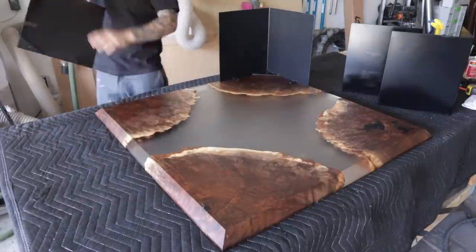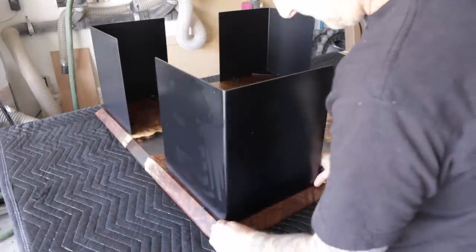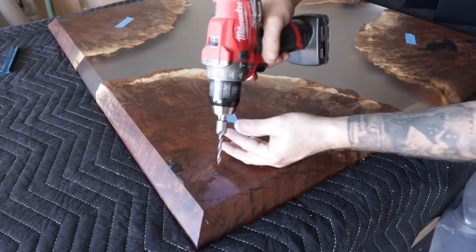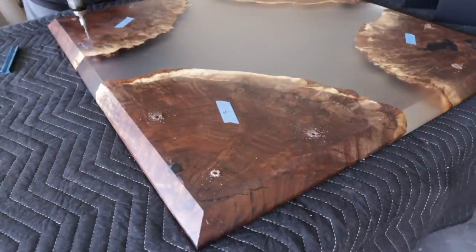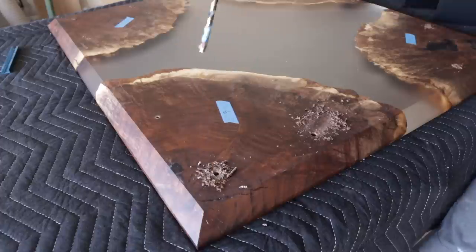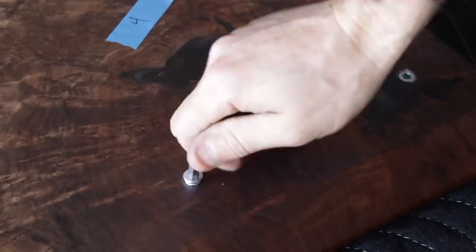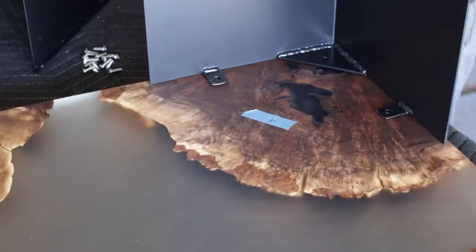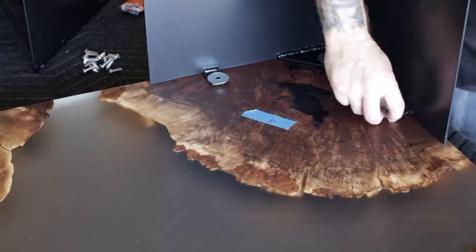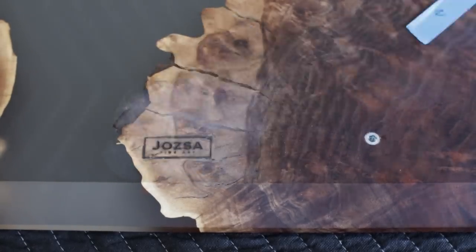I got the legs back — they're not as dirty as they look, just not wiped down yet. I tried to get them in place to see where I liked them, wanting them close to the edge. I marked the holes out and began drilling for the inserts, doing a little pilot drill first to make sure I was where I wanted before doing the actual depth drill — just blue tape for my depth gauge. I put the inserts in using CA glue and they seem to hold up just fine. I had some oversized washers sitting around and used them just to see that everything lines up. I also added a little personal logo brand on the bottom — just a little feature that lets everybody know you're the one who made it.